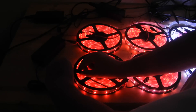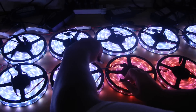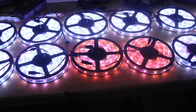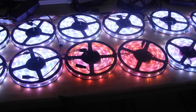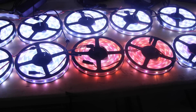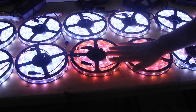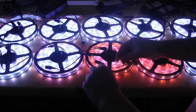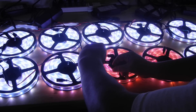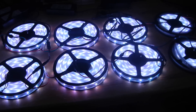Let me plug these back in so you can see how the color goes back to normal. I'll unplug just one right in the middle — see how these two aren't the same color as everything else. You don't want that effect. If you ever do have that effect, more than likely it's your power supply — you'd have to replace the power supply or you've got a loose connection. If you're using one big power supply and you've got a different color in the middle, check your connections because you lost power to that set of lights. Turn it back on and everything's back to normal.